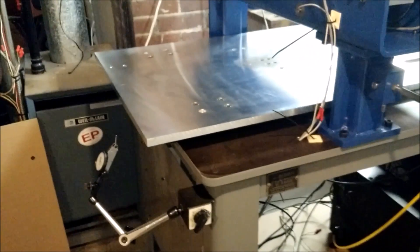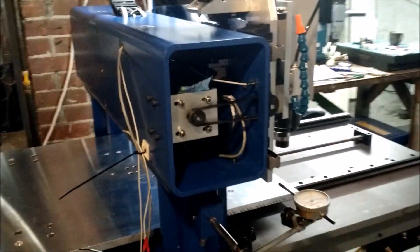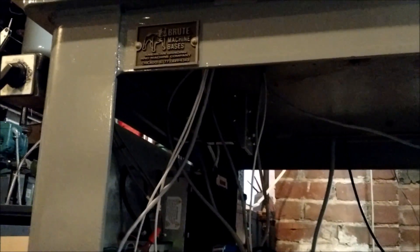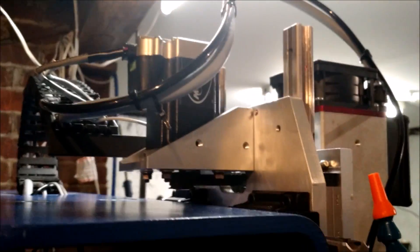I've got some indicators set up right now just to make sure I go to the home position and don't miss steps during some of the warm-up routines I'm running. The motors are Nema 23 motors — you can just about see one inside there. That's for the gantry X axis. The Y is underneath the table. They're all set up with pulleys and belt, with a bit of a ratio difference. And then of course there's the Z, which also has a pulley set up.